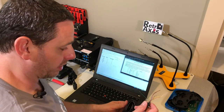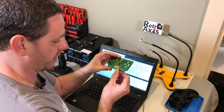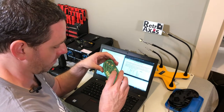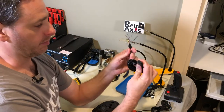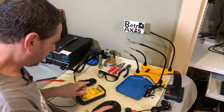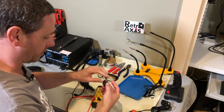We can do this one of two ways — use the multimeter to check continuity, or try to trace the wires visually, though that's probably more trouble than it's worth since some pathways are covered. So I've got a cable that's ready to go with the ends stripped. The next thing I need to do is figure out which color goes to which pin. I'm going to use my multimeter on the tone generation setting to figure out which pin belongs to which wire.